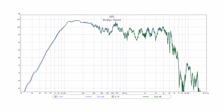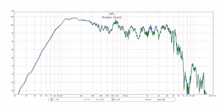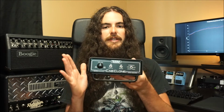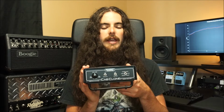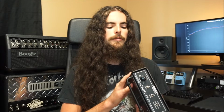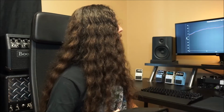I mean, have a look at this. This is your typical impulse response, where you can see for almost every frequency, there is an independent decibel rating, and that's why they're so high resolution and jagged looking. And when you compare that to the response of these cabinets, well, they don't even hold a candle to them. As this figure shows, not only is each cabinet model extremely smooth in terms of frequency response, which misses all of the detail that makes a speaker mic combination sound the way it does, which is accurately captured in an impulse response, but their only major difference here between the models is what, some presence at 3K?